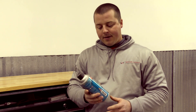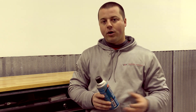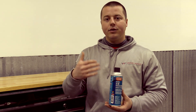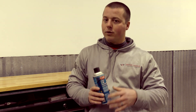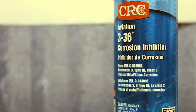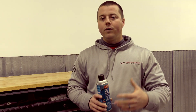If you don't want to clear coat an aluminum part after you vapor hone it, then this is something you should spray on it after you do the blasting process, and of course after you clean and get the part ready for reassembly. This is a product made by CRC — it's an aviation product that's sprayed on the aluminum parts of an aircraft like the wings and fuselage, and it helps eliminate corrosion on the aluminum substrate.